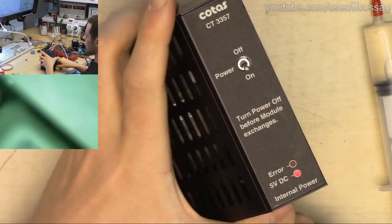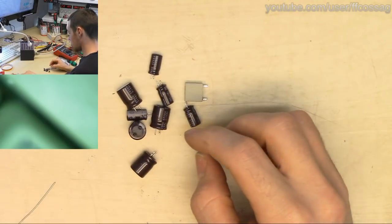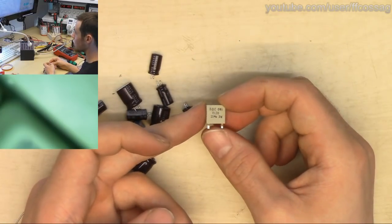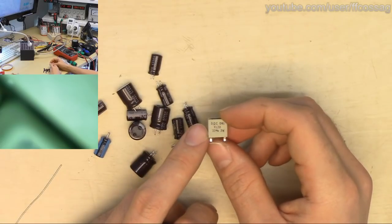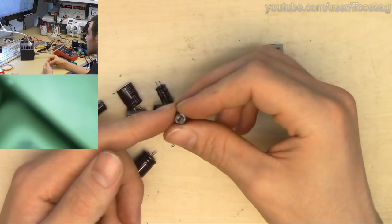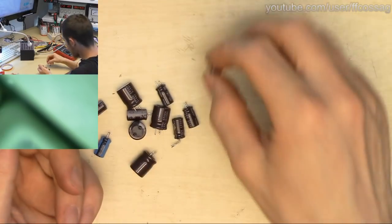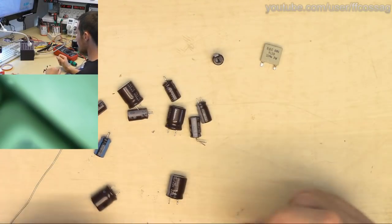We have replaced quite a few parts in this thing, actually, despite not finding any really serious issues with it. Two components had failed in such a manner that I would not have been comfortable putting them back into service. Let's see. So one was this current sense resistor. It's 120 milliohms and it measured 150, which is quite a ways out of its 10% spec. Since this is higher value than it's supposed to be, the current limiter is going to be lower, which could cause issues. The other component was one of these 100 microfarad 16 volt caps had leaked, actually. It still measured pretty fine, but when they leak they often go a bit weird and don't work properly. The rest of the components were just swapped out because they're older caps. They all measured fine, but they're 25 years old, so they are way past their sell-by date.